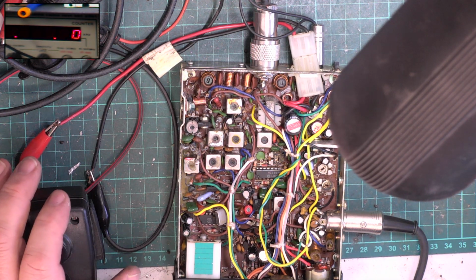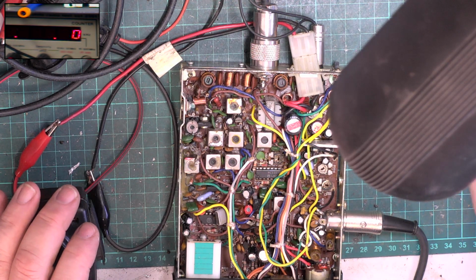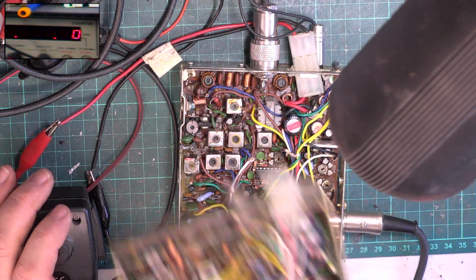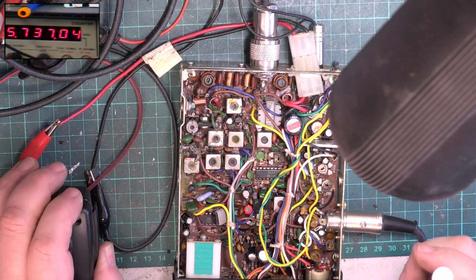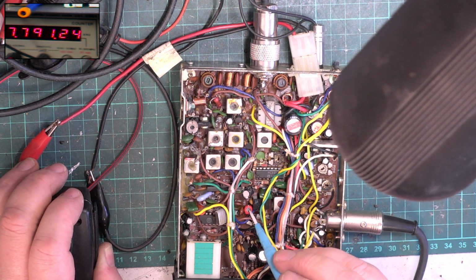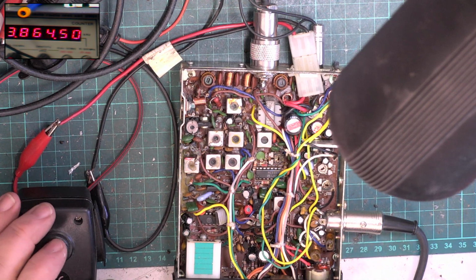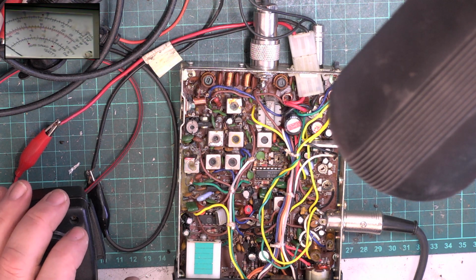I mean, that's taken over an hour, and of course I had to have a scrap chassis available to me to do this. Not of the set, but I said with that Midland 2001, which I happen to have got. So, frequency 27.79124, toggling 125. It's spot on frequency. The red trimmer capacitor there next to the reference crystal would be what would bring it on if it wasn't. So we'll just go back to the power meter just for the hell of it,